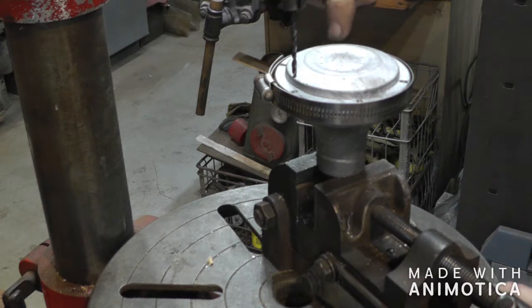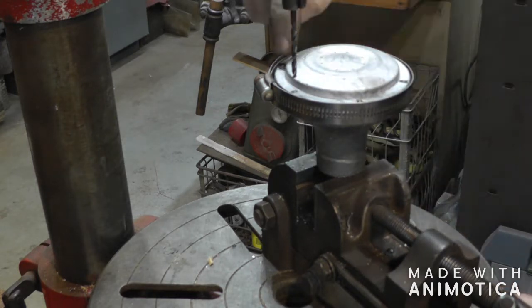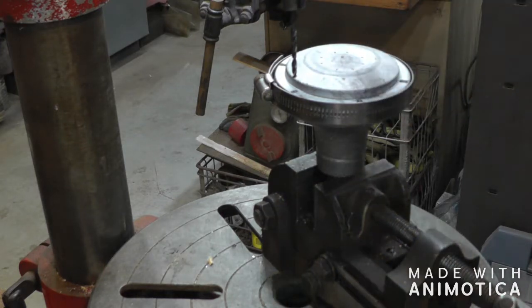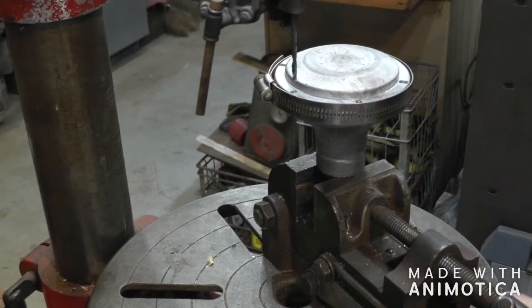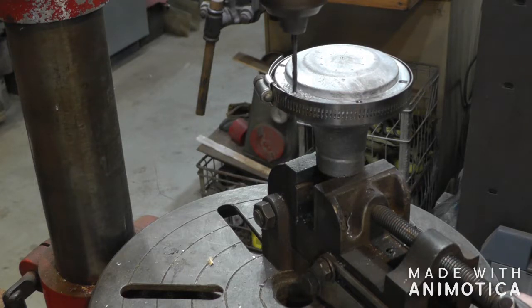And this is those holes that I punch marked on the mold when we made it. I highlighted each one of them with a magic marker, so make it a little easier. So as long as I'm showing you that, I might as well show you drilling the hole. Number 29 is the tap size for 8-32. Go through the front, through the baffle, and out through the back.